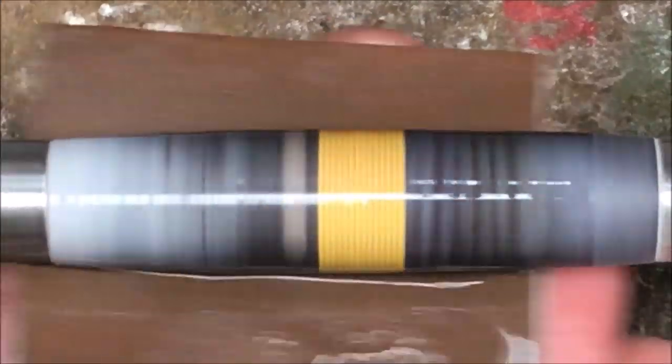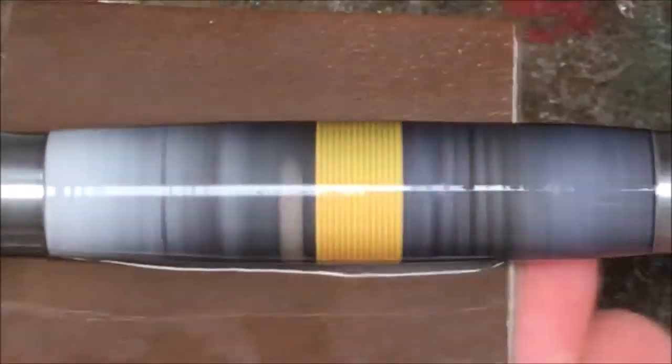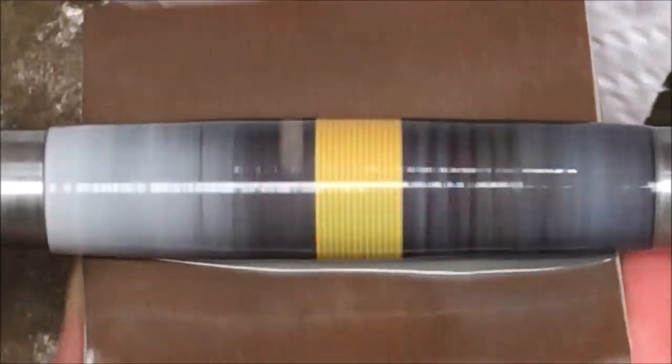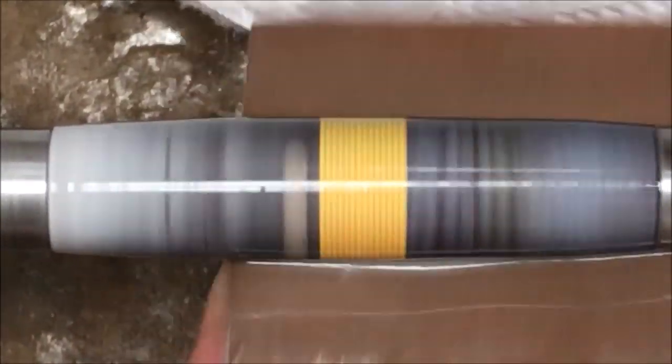For micromeshing, I'm down around 1,100 RPMs. I'm just going to run through the pads — there are nine of them — one at a time. As we build up a slurry, we'll wipe that off before we move to the next pad.